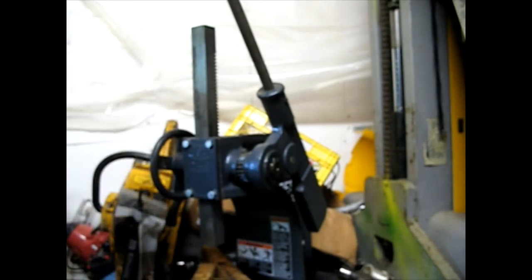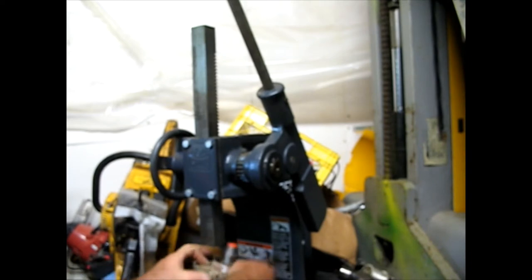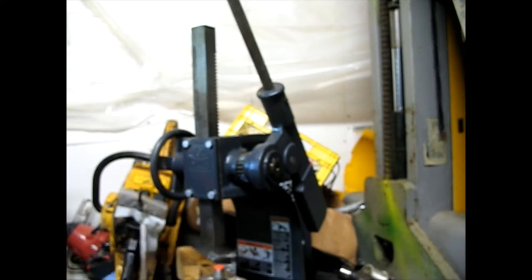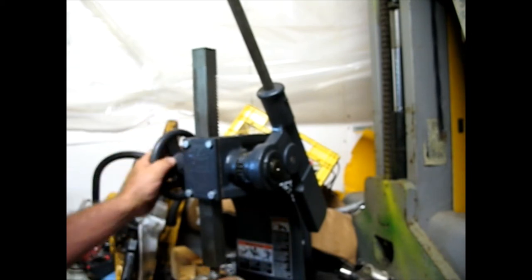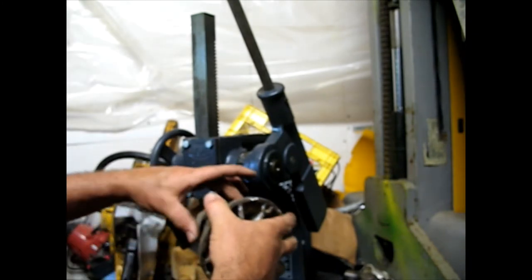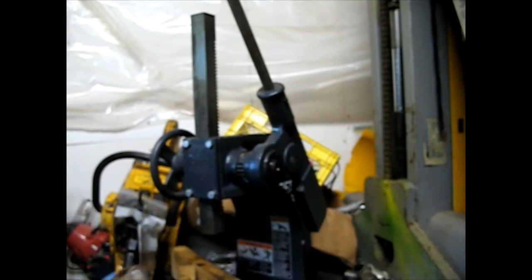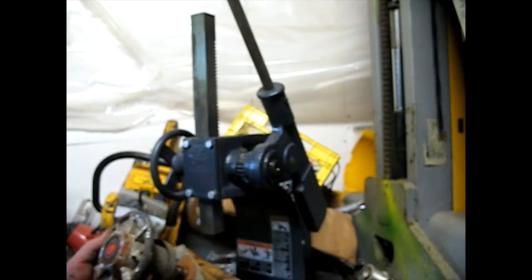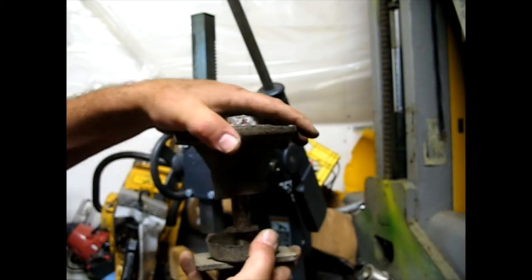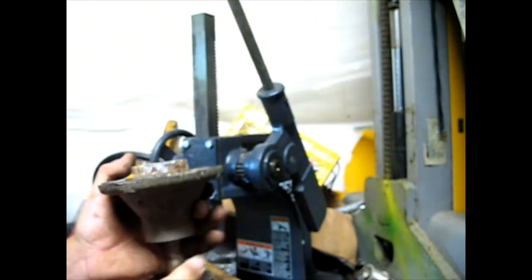There's your bearing — no problems. Let's just try another one and see if we get that lucky twice — and it literally falls out, that's awesome. This one came out but with no bearing still attached. Here's what's interesting: I didn't realize this piece is loose. Be careful — if you hit that too hard you're going to roll those threads and you'll be sorry. Also down here you can see it goes: the cone, then a spacer, then the bearing. Good to know.